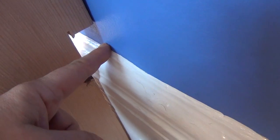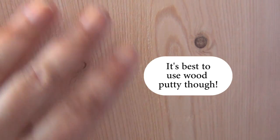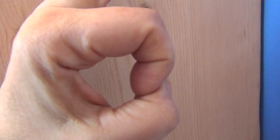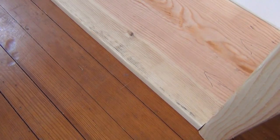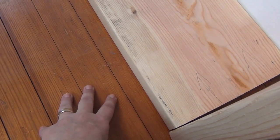Again, I'm going to have a baseboard right here, and this part right here, I'll probably just plug it and put some plaster to cover it. And I want to put some plaster on these as well, the knots, because believe it or not, after a few years, the sap seeps through and you start having a white surface with some yellow stains. So that's if you don't prime it properly. But if I put some plaster, it won't show. Okay, let me take a break and then I'll show you how to drill this thing into the floor itself.